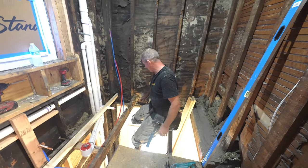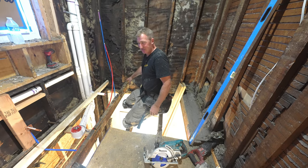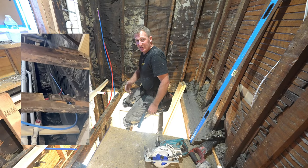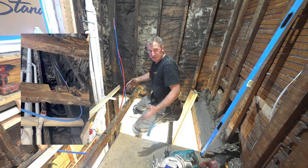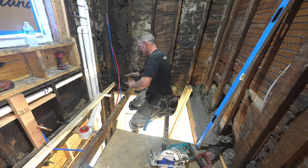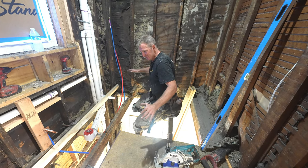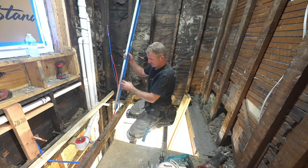It's time to finally get a floor underneath here. We have some serious issues with our structure — we're going to have to sister on new joists because this is completely severed, and we want to make sure we have good reinforcement underneath our tub. So the first thing you want to do before getting started with the lumber is to see how level your existing floor is.